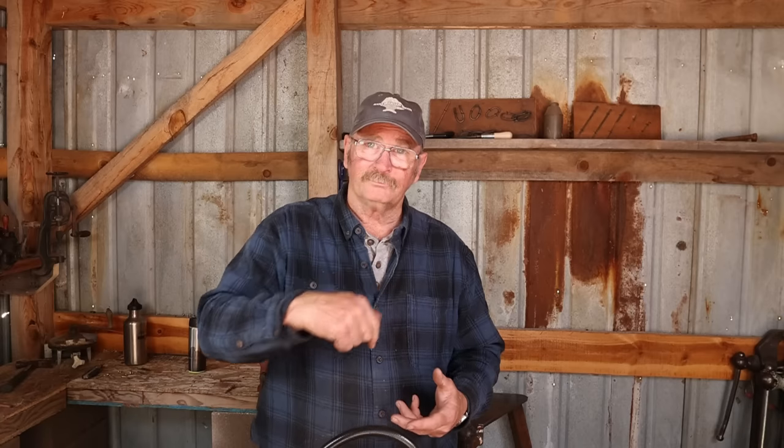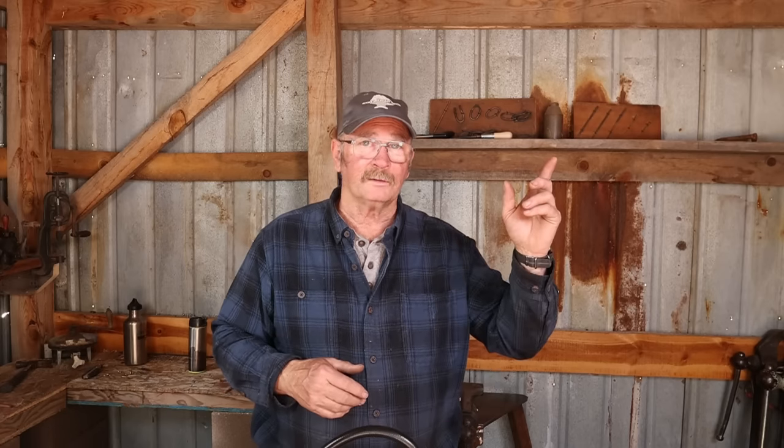It's a perfectly functional anvil. It's just kind of small, kind of light, and it has a few little issues that make it less than ideal, like the round hole that should be a Pritchell hole is down on the horn, where it's really just a place to run a socket extension through so you can bolt it down to a stump. I don't really see that as a deal breaker. The hardy hole is about the same size, so you can still punch through into the hardy hole. And if you haven't seen the video I did on that little anvil, I'll link to it right up here.